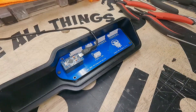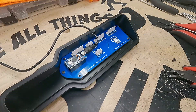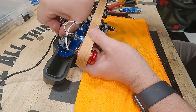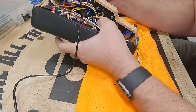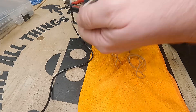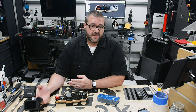With the board prepared, I mount it in the base using modeled standoffs and M3 screws. Once the board's mounted, I connect the headers to the respective sockets and then we're good to go. To semi-permanently seal the enclosure, I used a small bead of hot melt glue on the edge of the acrylic base, then mated it with the wood frame. I used rubber bands to hold the seal while the glue sets up. Now with the pendant ready for action, it's time to program some logic.